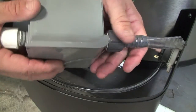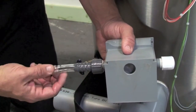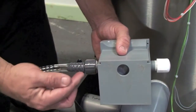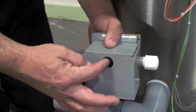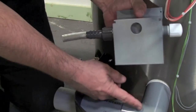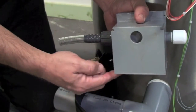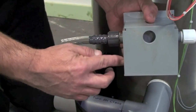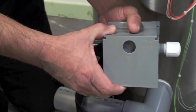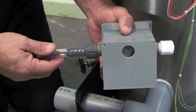You can see the way it's built. This is a patented device that we've designed. Here you can see this is our discharge, which connects up to another barb where your discharge line goes. You can simply change it from this side to this side. We have our connection point here, and the condensate flows in, flows down, gets trapped, and then it comes up. There's a secondary chamber where the condensate flows up and gets discharged. There are little lime crystals in here which neutralize the pH of the condensate, so when it's discharged, it's neutralized automatically.